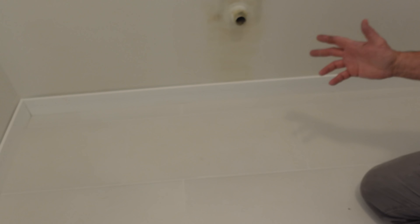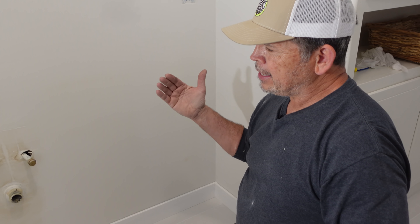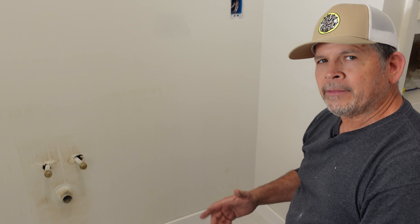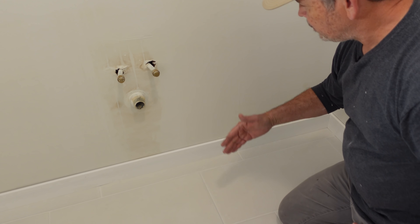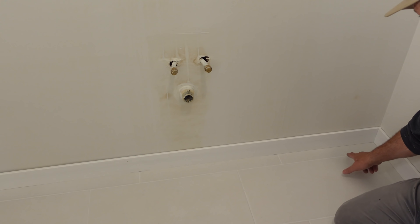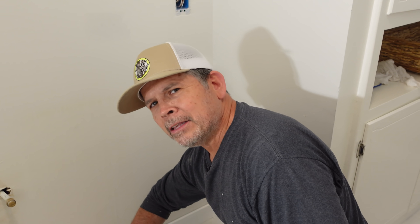The base is done and it looks just okay — and why? Because there are some pretty big gaps between the base and the wall. This is a remodel with original drywall and it's going to have waves in it, especially on a plumbing wall. If I nail this thin base to the wall every 16 inches into a stud, we'll have a wavy base. But check out this nice straight grout line — our baseboard is parallel to it and perfectly straight. All we're going to do is caulk it and trick the eye into thinking the wall is straight by making the baseboard straight.